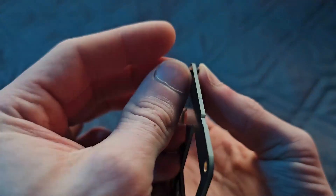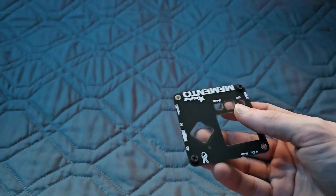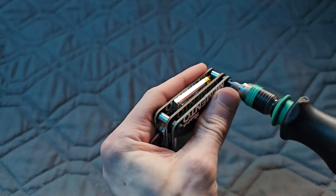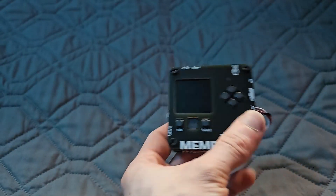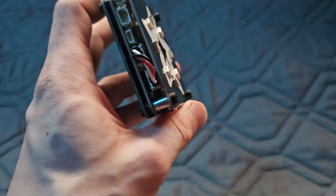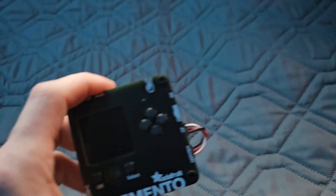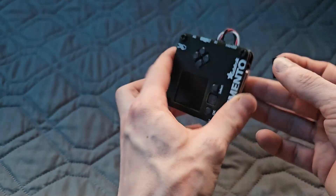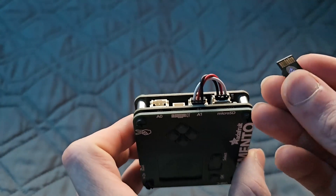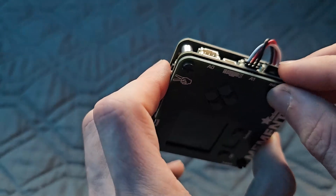They've included some plastic nuts, stackers, and spacers between the screen side and the plate, so you've got to install those first, then mount the plate to the camera itself, and then we're all good. And that's all she wrote right there. Let me get a quick overview of the layout here. Time for the standard annoying micro SD card installation — make sure the little gold fingers are pointed downwards towards the circuit board.